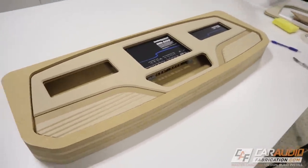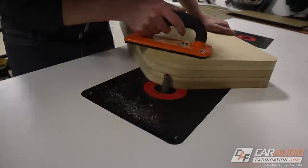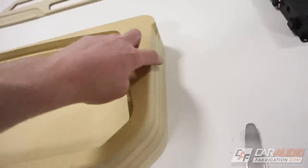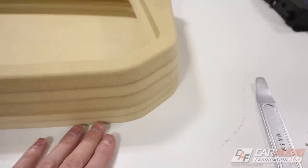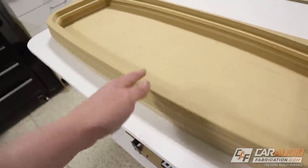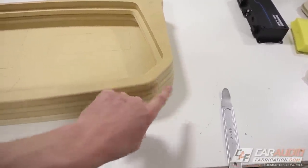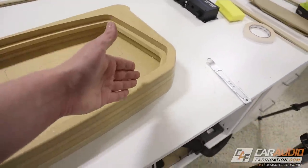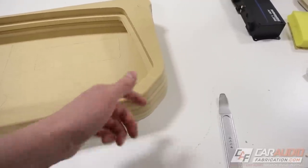We're going to be using a couple of special router bits to do this. The first bit is the rocket bit — this is a rather large bit, so I'm only going to cut about half of the cutting height on my first pass, and then I'll raise this bit up and make a second pass for the final cut. After making those cutting passes you can see it has this nice round over on the top edge, and it did cut at an angle, but I do think I want to change this up a little bit. In my rendering I used a 30 degree bit which gave me a much better result. But I wanted to try this bit first because it removes less material — if you aren't sure what profile bit you want to use, always try the one that removes less material first, because since I don't like this result, it's not a big deal and I can now do the different bit.